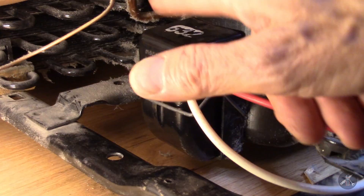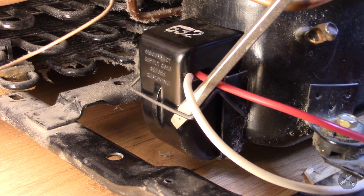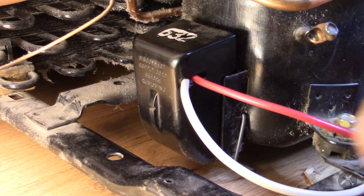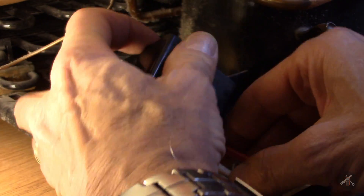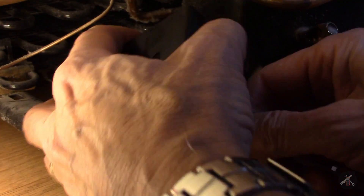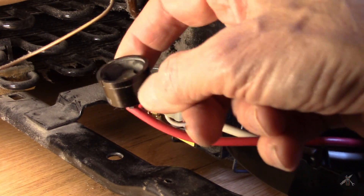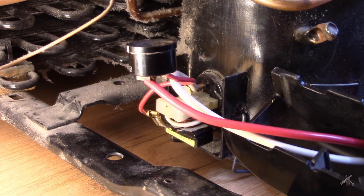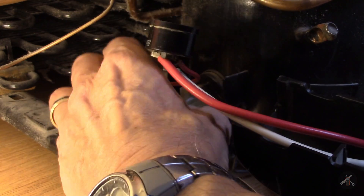This is how mine is put together - it's got a cover over the connections on the side. I have to pop this open with a screwdriver just a little bit and pull the cover back off. The overload on this one just sits in this cover and it's got two wires. This is the old overload, which also isn't available, which is why it's getting replaced. The white wire for the common on the compressor is up on top.